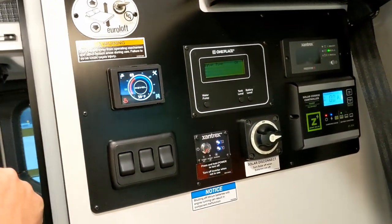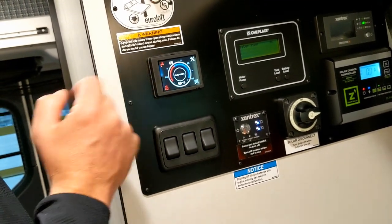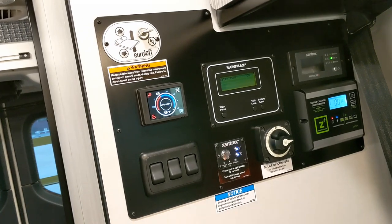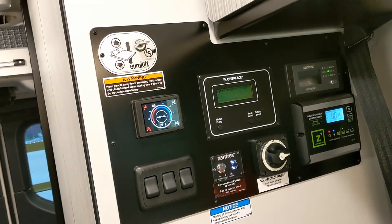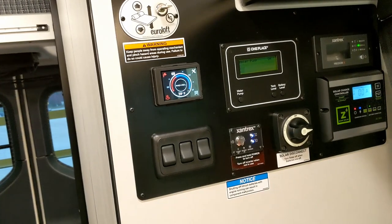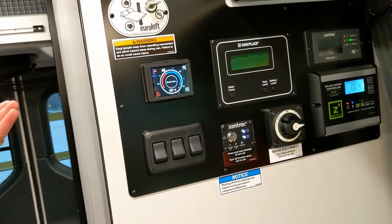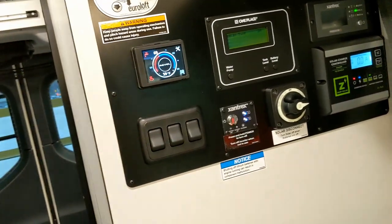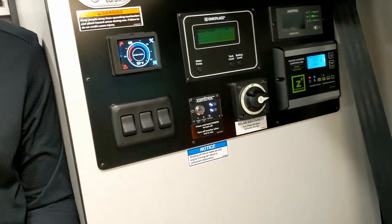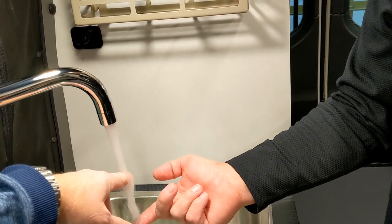Back to heat — that's how you keep heat going. To get warm water at the same time, press that water button. In summertime when you mostly just want water, press water first and then decide: diesel burner or electric. Once you hit water it's waiting for you to tell it how to heat. There's a 30-minute timer that comes up, and it shuts off automatically after.